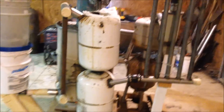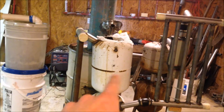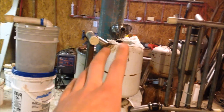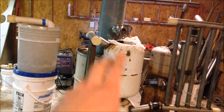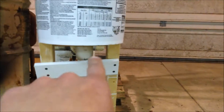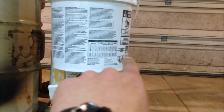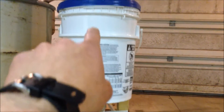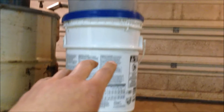That's the first one. Basically, the idea here is that first filter carries big chunks of wood and stuff for big particle collection and tar and everything. It goes through my radiator into the bottom of that filter. Into the bottom of that filter is a layer of mesh right here being supported, and on top of there is about 25 pounds of wood pellets. So that gets the finer stuff.